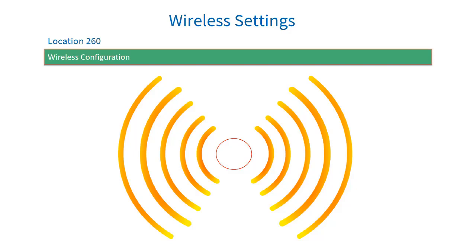Sublocation 2 is delete wireless detectors. Go to sublocation 2, enter the zone number or scroll to the zone you want to delete, and press star to delete the detector. Press hash at any time to return to the sub-menu. Sublocation 3 is signal power of receiver — this menu is only available on LCD keypads. You will need to trigger the zone to get a signal power update. This is only used for X-Wave and does not give a true reflection of X-Wave 2 device signal strengths.